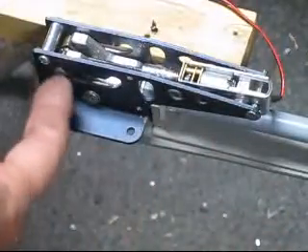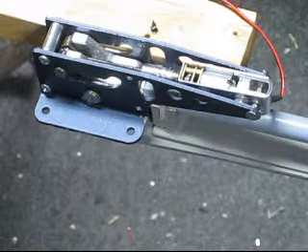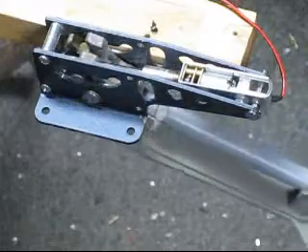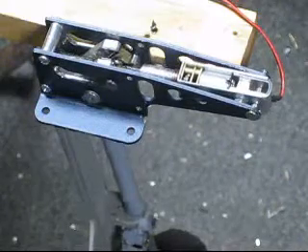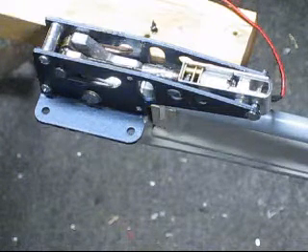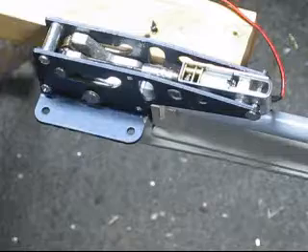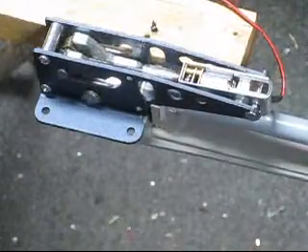What's really holding the gear up and down is the actual trunnion locking mechanism. So it kind of relaxes the actuator on either end. With the mechanical locking mechanism, you can actually back off the actuators and free up the pin. You can see how loose that is — there's no pressure whatsoever on the actuator. Pretty slick.